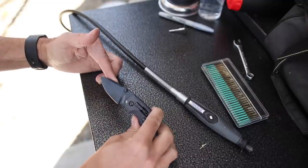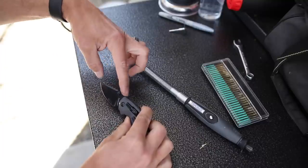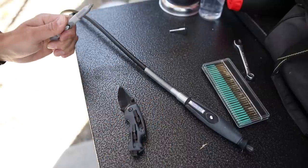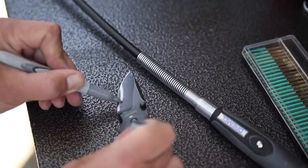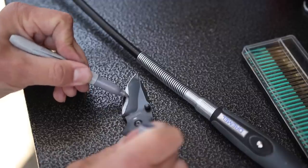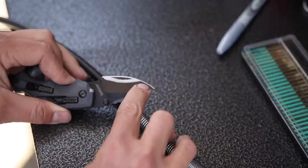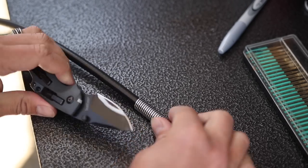As for the actual serrations I'm going to cut, I'm going to change up the blade shape just a little bit because this is a really short, stout blade and I don't necessarily want it so stout — it makes it a little less utilitarian. So I'm going to add a little bit of a recurve. Using a silver Sharpie, I'll mark the shape — it's going to leave me almost with a little tanto edge up there that I'll leave plain. I'll add serrations into this recurve area and leave a little plain edge right there, because in my opinion serrations work best if you have a little plain edge to guide your cut, and then as it guides in, the serrations bite and you can really rip through whatever you're cutting.